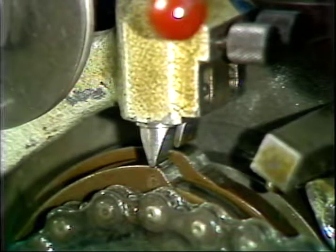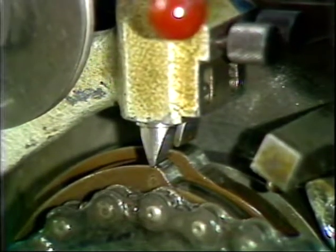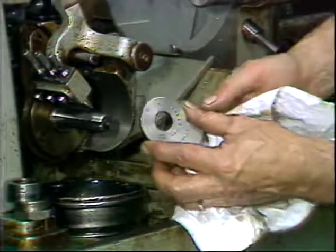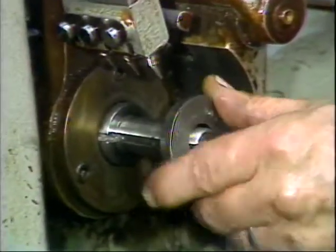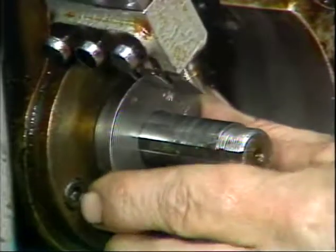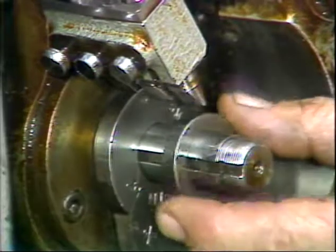Before mounting the drill and counter-collet cams, make sure that the main camshaft is set to its 0 reference position. 0 of the main camshaft will correspond to the 0 of the drill turret camshaft. Wipe down the cams and camshaft before mounting. Install the counter-collet cam on the camshaft with its 0 mark facing out. This is tool position number 3. Align the 0 mark under the follower.